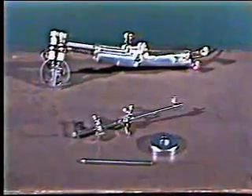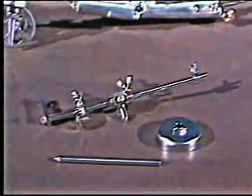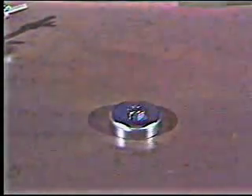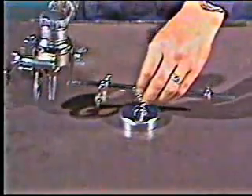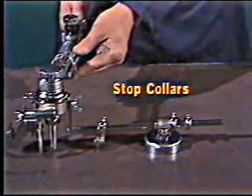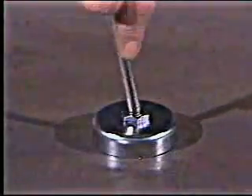The Handy Auto also has two larger optional circle-cutting attachments — one for cutting up to 20-inch diameters and another for up to 40 inches. They come with a magnet and centering point that helps you find the center of the circle, which becomes the center point on the radius rod. The radius rod is used with the standard drive wheel. Stop collars allow you to slide the torch into the cut diameter for a smooth start and stop on your cut.